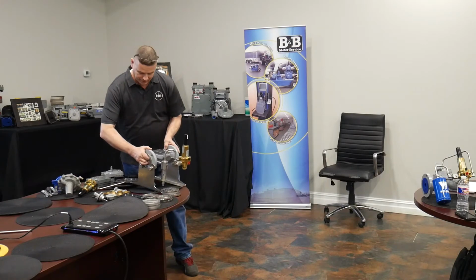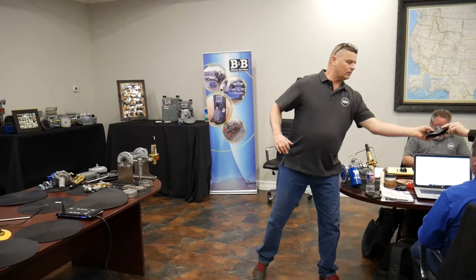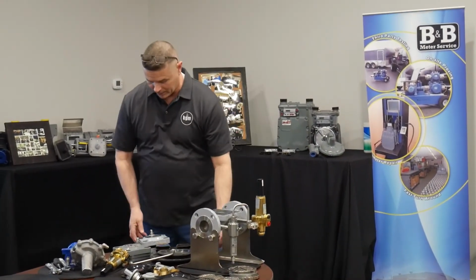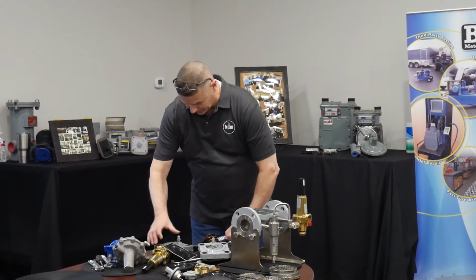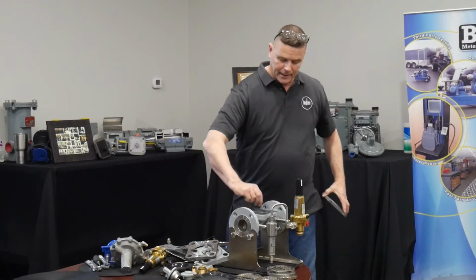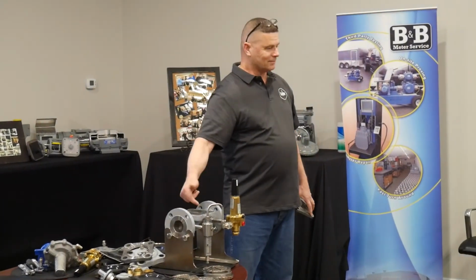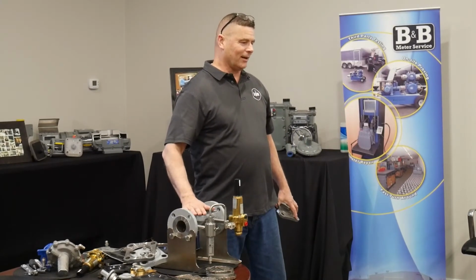All right, where's my flexible elements back? Did it get around? If not, we'll make sure it does later. I just need the standard port one back real quick. So we're going to rebuild this like we're starting from a standard port. The way it would have looked then is we would have had a throttle plate down on a body O-ring. The body O-ring's job is to make sure that the gas is required to go over that wall, over the bridge, and can't escape and go other places that we don't want it to go.